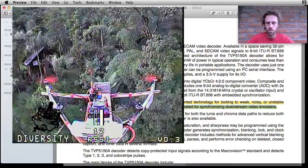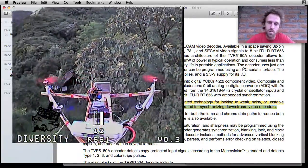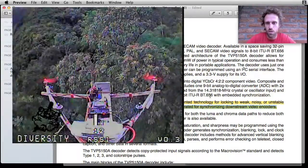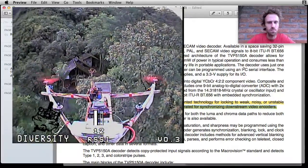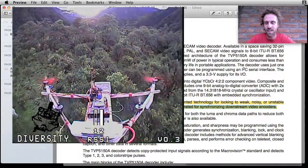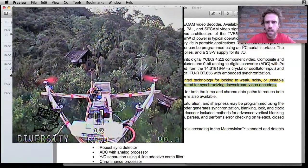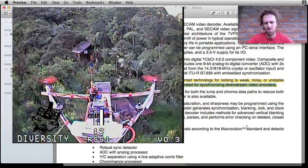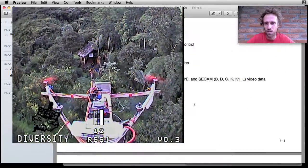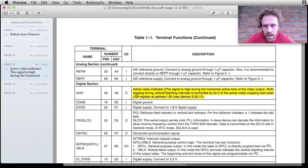I had a whole lot of trouble switching video signals and putting that into an on-screen display. The diversity controller was putting OSD on-board, but it didn't work because I was switching and all the sync timing was out. The Maxim chip decoding the video wasn't as good as this Texas Instruments chip at locking onto a weak signal. When you get a nice clean signal straight out of the camera it's fine, but with a noisy signal it can't lock on. Maybe I could use the TVP5150 ahead of the Maxim chip to feed timing information to it for OSD — but it's getting really complex and driving the cost up. The chip also has an active video indicator that tells you if it actually has a video signal.